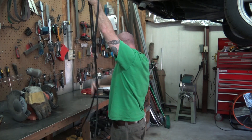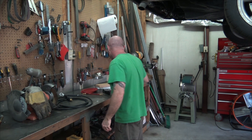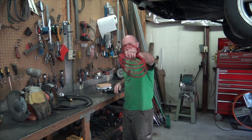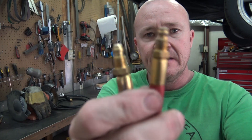To upgrade this, I got a super flex hose. You get that from USA Weld — pretty sure it's USAweld.com or USAwelds.com, but Google it and you'll find it. Click on their drop-down menu, go to TIG torches, then Harbor Freight, and that'll take you where you need to be. You want the plain hose — it's got these little nubs on the bottom. That's the one you want, and it's the cheapest. The 12-foot hose is about 50 bucks plus shipping.